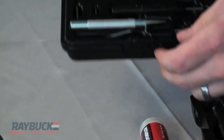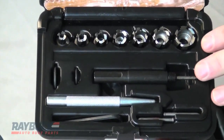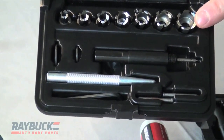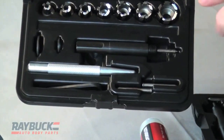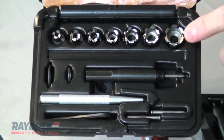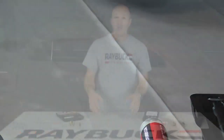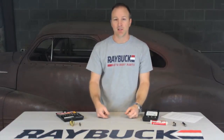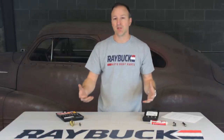One other thing I forgot to mention on the rotor broach kit: you can get these types of bits in diameters all the way up to about an inch and a half. This particular kit only goes up to three quarters, but these types of bits are available in much larger sizes. So those are the types of bits and hole cutters that we offer. You might find different sizes and lengths on some of these, but those are the different types you're going to see for this use — whether you're drilling on a spot weld, drilling holes in sheet metal, or doing any type of light chassis work. Thanks for watching.